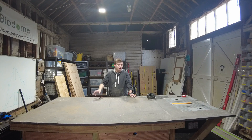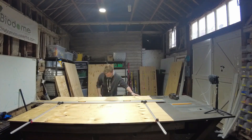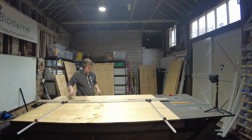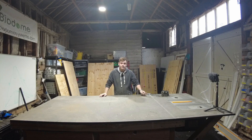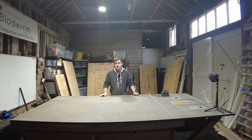Ten minutes in, I'm just going to lay one of the next boards down, mark up for the next cut, and we'll go through the six bigger pieces to take off another piece. That shouldn't take too long. The parallel guides work really well - they reproduce really accurate cuts again and again and you only have to measure once, so you don't introduce errors. I'll cut up the last pieces and we'll get on with the next bit of building the CNC torsion box.